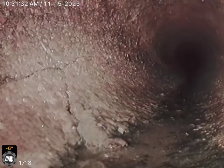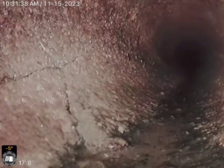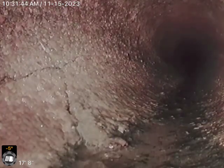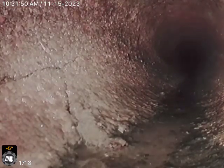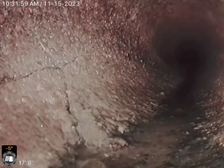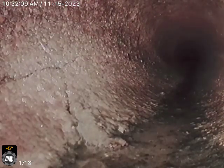Back to the epoxy — what we would do is locate where this piece is exactly outside. It's going to be right outside the front. And then we install what are called two-way cleanouts. They're required by code — sections of pipe. We do a 10-foot repair, and it's sections of a four-inch pipe that come flush to your grass. That way they're access points, so if Jose ever needs to service the system in the future, we don't need to go through this cleanout right here. We use our epoxy lining machine, go through those cleanouts, and it shoots in an epoxy-coated pipe in place of the concrete pipe.